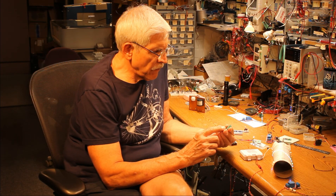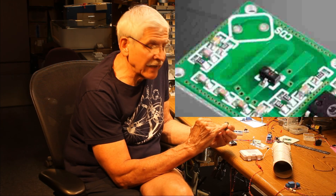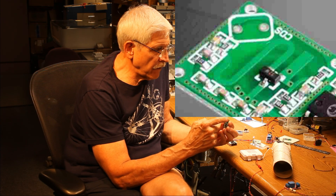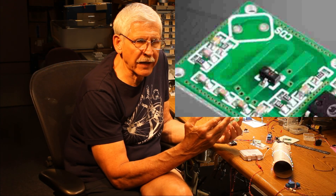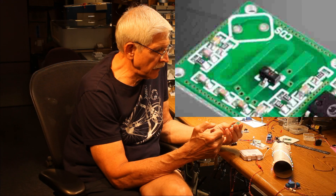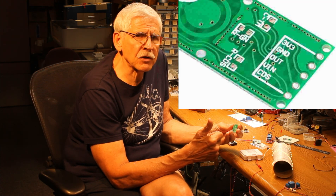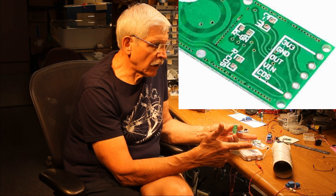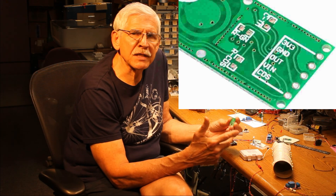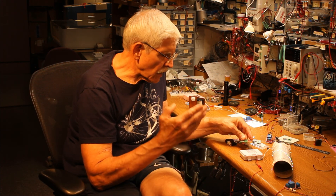There are four additional connections you can make to this board. Up in the corner is a spot for a cadmium sulfide photocell — a light sensor. From what I've read, if you put the cadmium sulfide light sensor there, this will only work at night, which would be good for something like driveway lights that come on when motion is detected. On the back there are places for three surface mount resistors: one controls the sensitivity of the cadmium sulfide photocell, one controls how long the output stays on when it detects somebody, and the other changes the detection distance sensitivity.